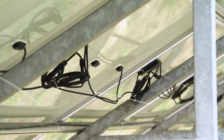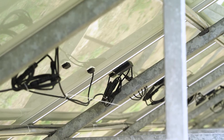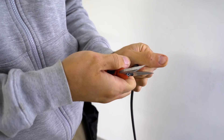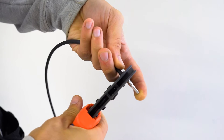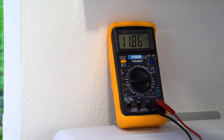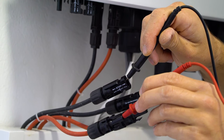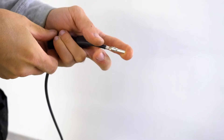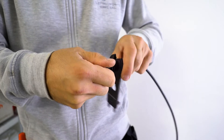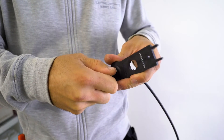In some cases, it may happen that the distance between the terminals of the optimizers is too long, so you might need to enlarge the cable. Strip the insulation of the cable and attach a crimp contact. For this, you have to check the polarity, because each pole has different terminals that need to be crimped. The polarity is marked on the optimizer. Then push the cable into the insulating sleeve until it snaps into place. Screw it and that's it.